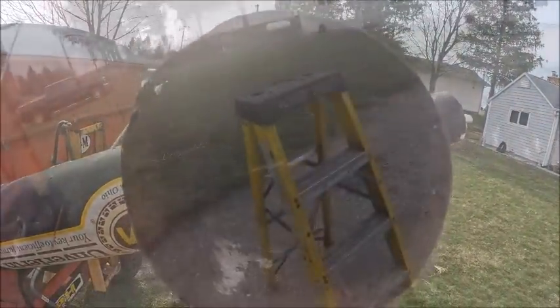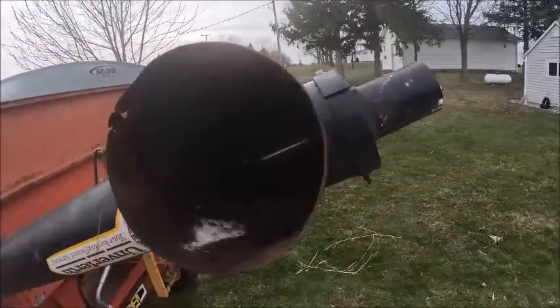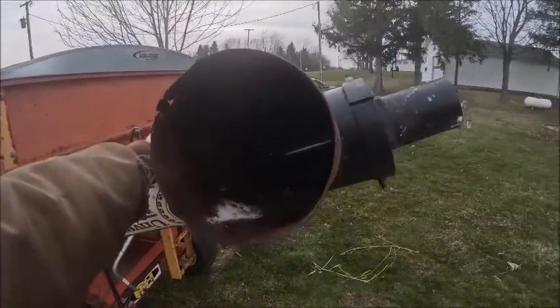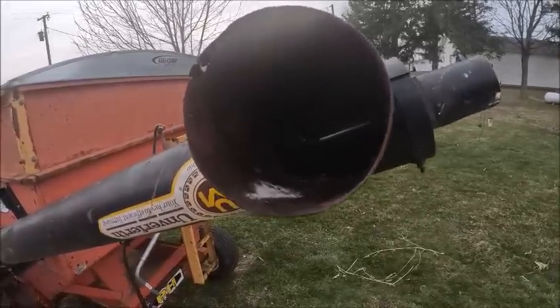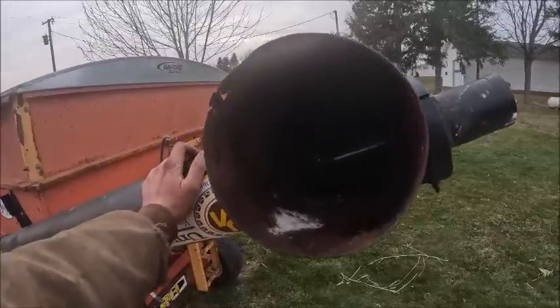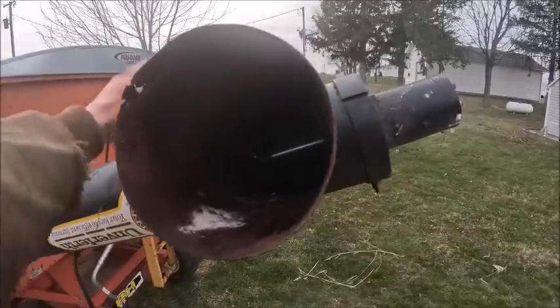Okay, now comes the part where I'm gonna have to set you down so I can get that bolt hole lined up. All right, it's in there after a struggle. Either the shaft in this motor was not exactly 1 inch, or something, because I ordered it for a 1 inch stub shaft, which is basically the most common, and slid it on there, went on about a 1/2 inch, stuck. Okay, got some emery cloth, tried my best to clean the end of the shaft up on the motor, went on 1/2 inch, stuck. So naturally I sprung for the stainless steel tube for the center tube of the auger, so you can't just go at it with any old drill bit, and even if you could, you can't get it in there because the sections are too long.